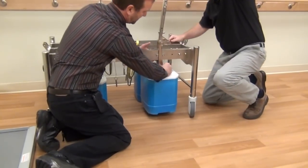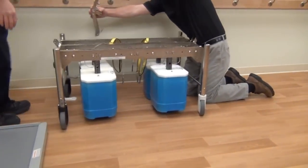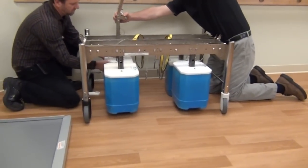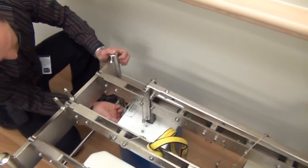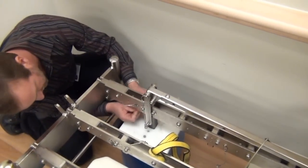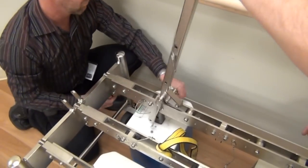The pumpkin weight will easily lift off the ground with minimal effort on the handle. The lever handle has been designed with an overlock fulcrum. By completely lowering the handle, it will overlock and remain in place until the operator lifts the handle upward. With the pumpkin weight supported by the lever linkages, use the shorter ball detent pin to lock the pumpkin weight to the load beam.